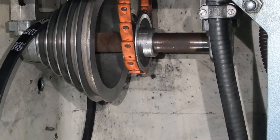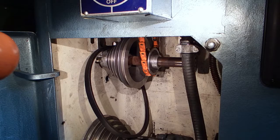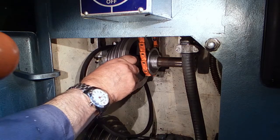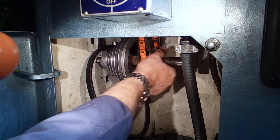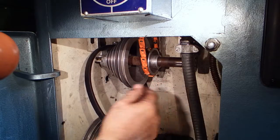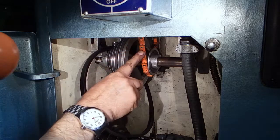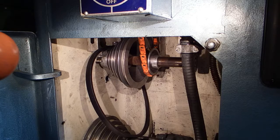What I need to do now is put the four nuts and bolts back in and then align the belt by pushing it backwards and forwards to get it back in a similar position to where it was before. I've put the bolts in loosely — you can't move it left or right but you can push it backwards and forwards. I'm just bringing it forward on each bearing housing so I know that it's square. I've also checked that the headstock belt is clear where it goes through the lathe base — there's a slot, so you want to make sure the belt's not running up against the lathe cabinet, and that's clear.